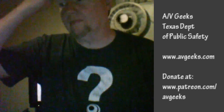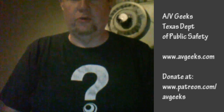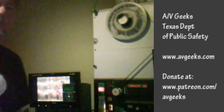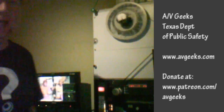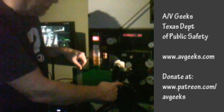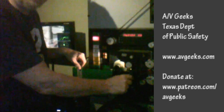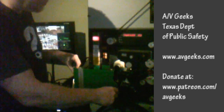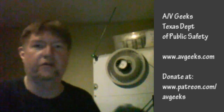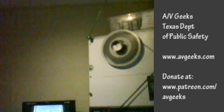All right, so we're going to rewind that. Kevin Kilbourn wrote Rotating Prism. No, actually not a rotating prism, other folks use that. This is actually, there's a camera here, there's a mirror, then there's an LED thing that pulses. It measures where the sprockets are and then does a trigger based on that. So if it misses the trigger, the image rolls a little bit. There you go, more than you would ever want to know about that technology.